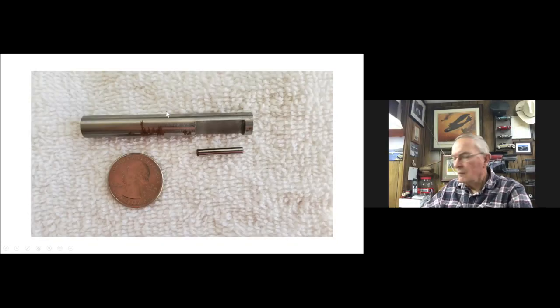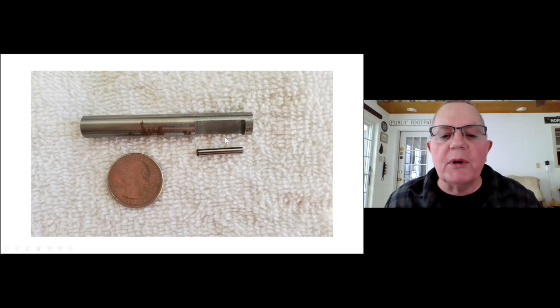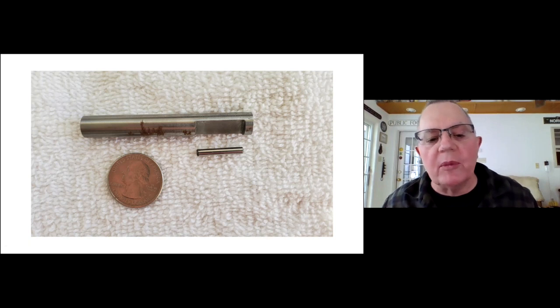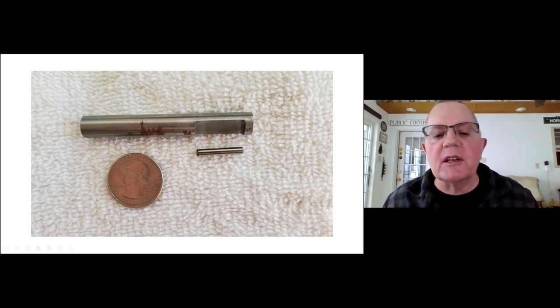This is a pin chuck. This was mentioned earlier. This is a 3/8 pin chuck blown up. These were very popular for a while. You're doing some stuff fast. You drill a 3/8 hole in it, you put it on here with a pin up in here, you give it a twist clockwise, it locks it in, you turn your piece, you take it off. The disadvantage with this is it's very, very hard to take something off and reset it in the same place. You set it once, you turn it. It's really made for very fast production turning.